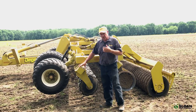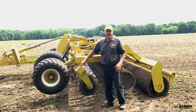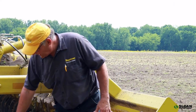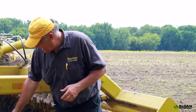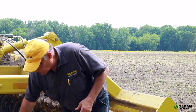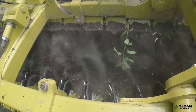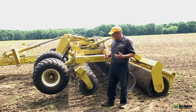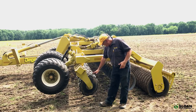The heart of the machine is our torsion rubbers on each individual disc arm. Each individual disc arm has four inch-and-a-half rubbers, which allow for more travel compared to most of the competition. The larger the rubber, the more pressure you're going to put onto the ground and keep it in the ground in harder soil conditions. The arm has the ability to travel 11 inches to step over an obstacle such as a rock, stump, or well head — it will step over it.